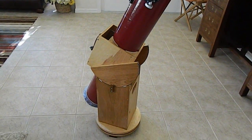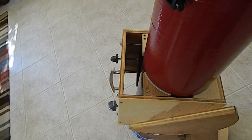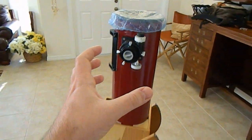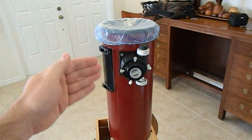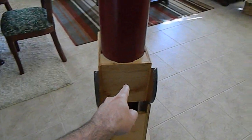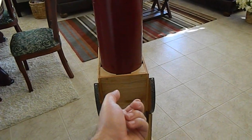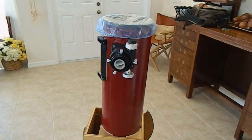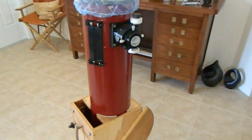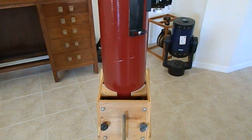I'm going to show you what I feel were the mistakes we made while building this. First thing is, notice the gap between the scope and the cradle — that actually makes the scope unbalanced. I rotated the tube so the focuser isn't adding counterweight to one side. I'm going to put some sort of counterweight over here, maybe with a clamp, or glue an aluminum channel and attach a counterweight, to help balance the scope. Once I rebalance it, I'll rotate the tube to about a 45-degree angle — it's easier to put your eye into the eyepiece that way. Try not to leave that gap and you'll have fewer problems.